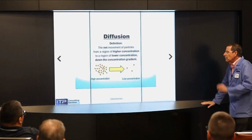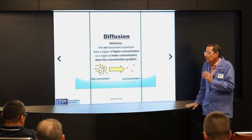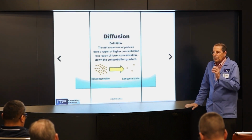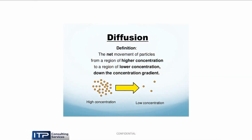So we don't want pure zinc. The original coated wires were zinc, which we'll talk about in a second. But the problem with pure zinc is it has a low melting point. So we often want to have a high zinc brass on that coating. And how do we do that? We plate the core with zinc, we heat treat it.